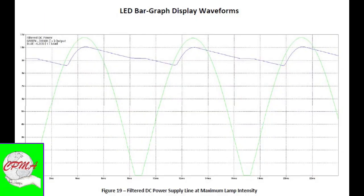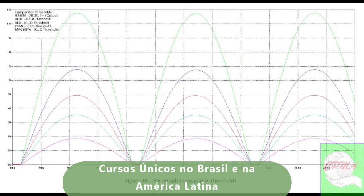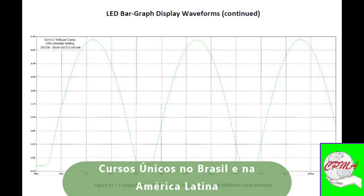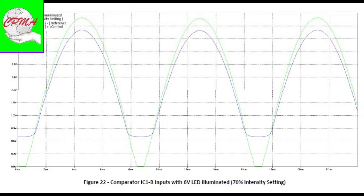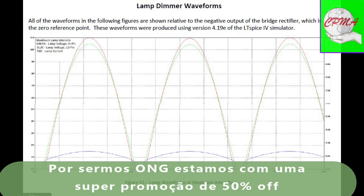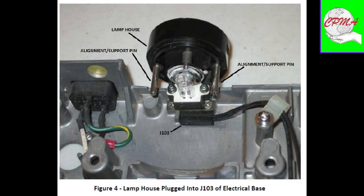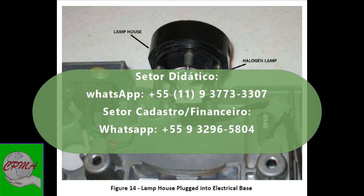The electrical circuitry of the Olympus BHT-BHTU resides completely within the base of the microscope stand. AC power is provided by an AC inlet jack on the back where the line cord connects. There is a power switch on the front to turn the illumination on and off, as well as an intensity control on the right side to vary the lamp voltage. There is a switch on the bottom of the base to allow operation under low line conditions, and enclosed within the base are a power transformer, a power transistor, and a bridge rectifier.